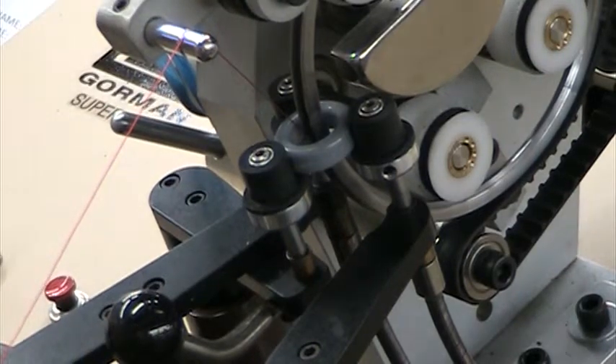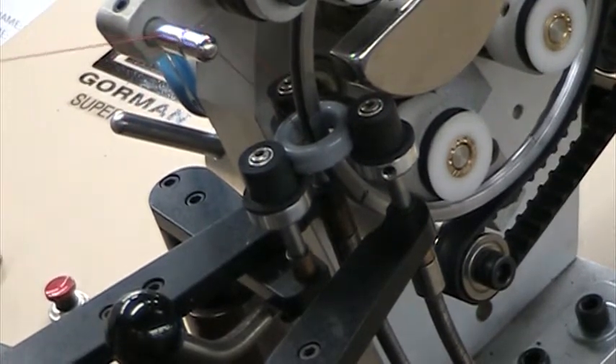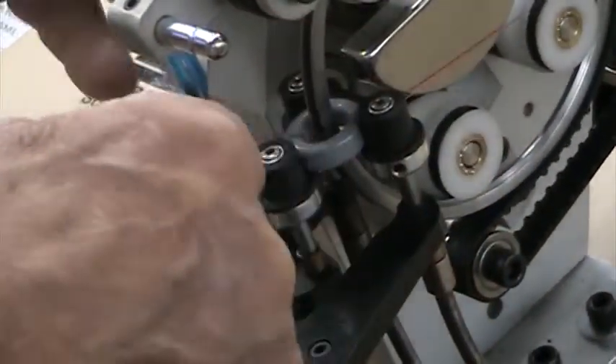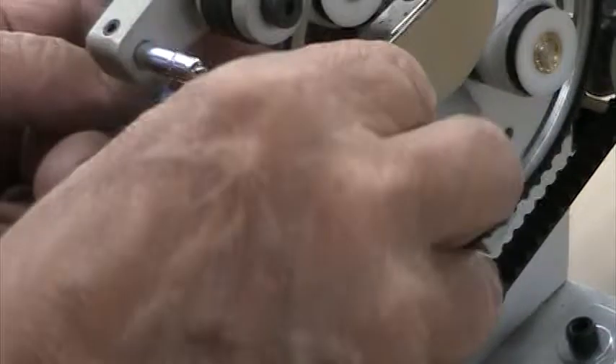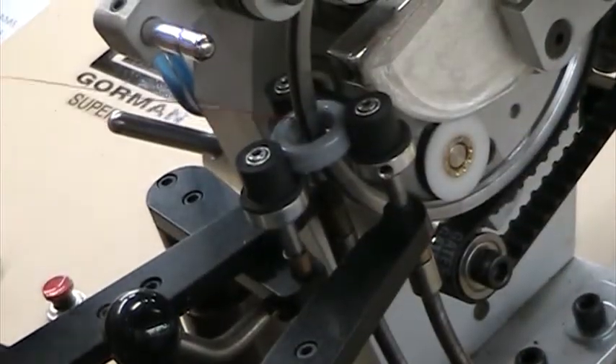This is loading eight turns. This is going to be a progressive sector winding. There's going to be four sectors of progressive wound sectors. It's going to be winding four in one direction, two in the other, for a total of 22 turns.